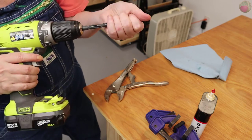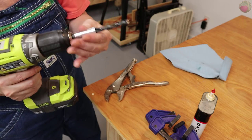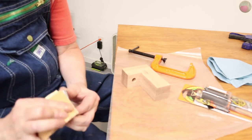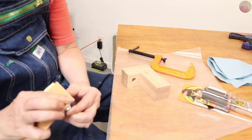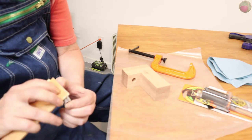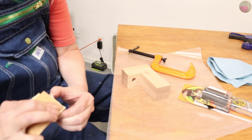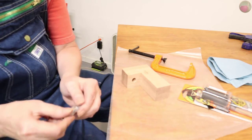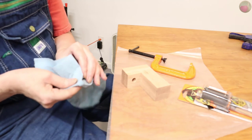Check the clearance by hand to ensure your 3/8-inch bit can glide through the spacer. Now it's time to prepare the spacer to be inserted into the block. That spacer is as smooth as glass, so you need to rough it up a little to give the epoxy something to bond with. I used an old piece of sandpaper to scuff it up, going up and down so the scratches line up with the direction I'd be inserting the spacer into the wood and won't bind.